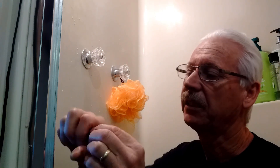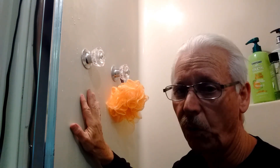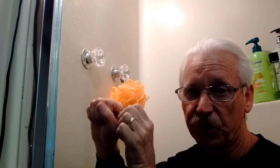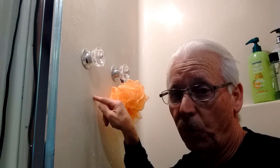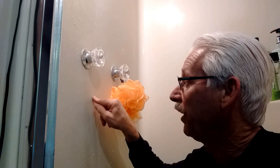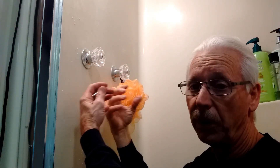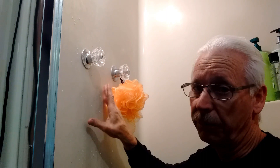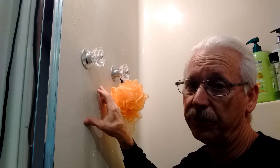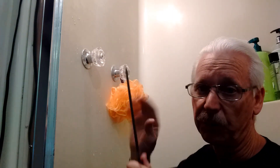Here's the problem: this little seat sticking out like that screws into the faucet behind the wall. If you can't get that old seat out to replace it with a new one, what you're looking at is going behind the wall — in this case, a closet in a bedroom — and knocking the wall apart and replacing the whole manifold piece that these screw into. So you're talking a major plumbing job, and I just avoided that whole big job with a couple seconds with a file.